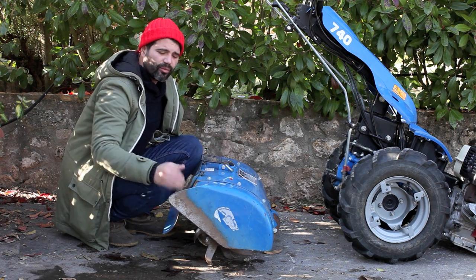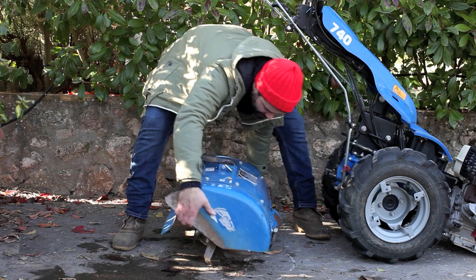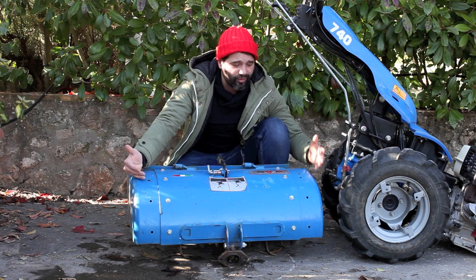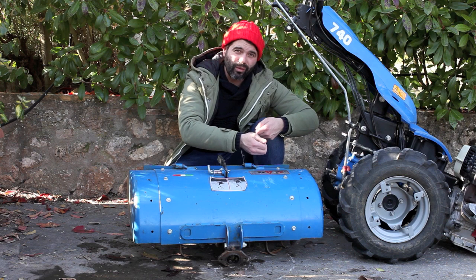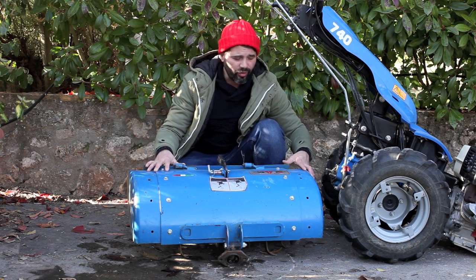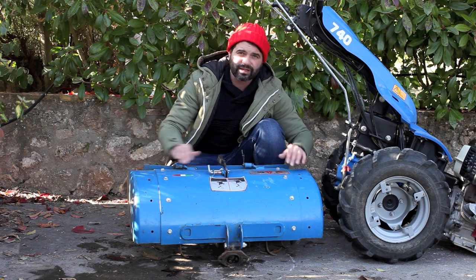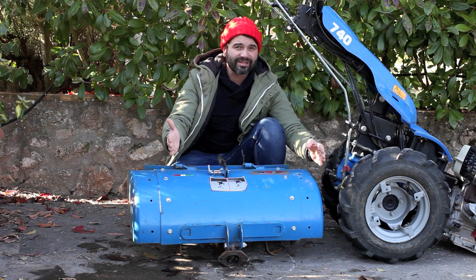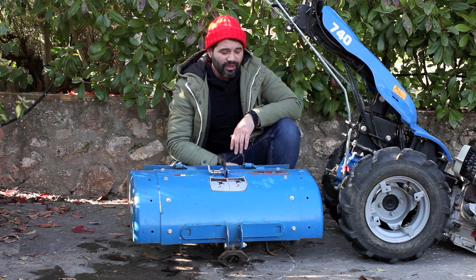The advantage of this tiller is that you can remove inner tines and close the sides to configure it to two different widths depending on your crop. At its wider setting this is nearly the width of modern corn spacing, so for small artisanal sweet corn cultivation you can get pretty close down the sides — though you'll still need to run down with a hoe or the hiller between plants for weeds. It's really great for quick passes to lightly cultivate and keep weeds under control. You can also adjust the depth of the tines, which is useful even when using plastic mulch — you can make it smaller and run down between the mulch strips.